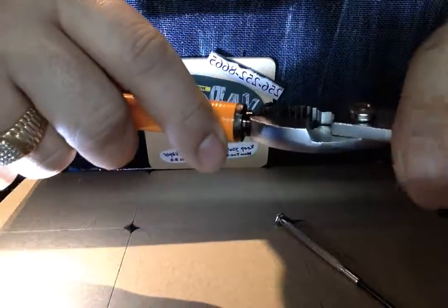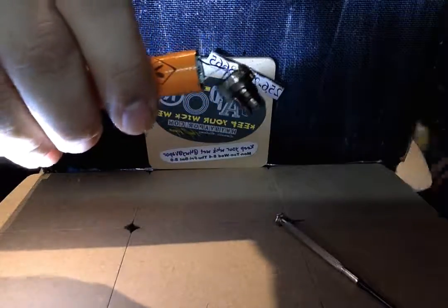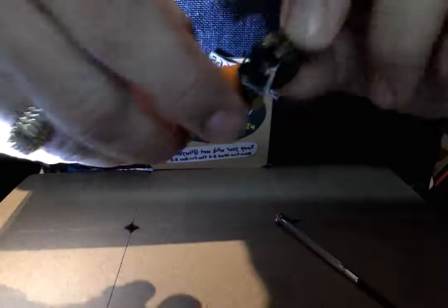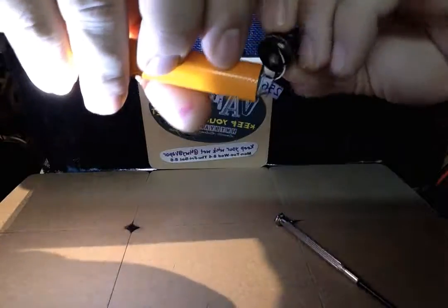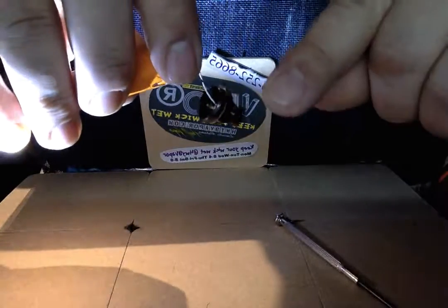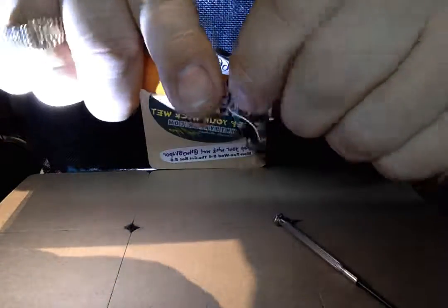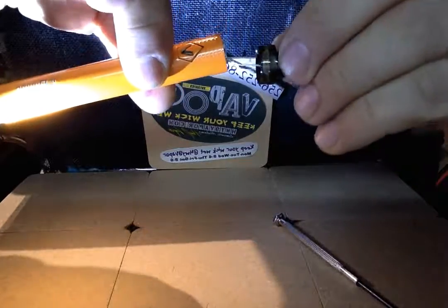So what I'm going to do is take this battery apart to show you more of what I'm saying. As we pull it apart, you'll see there are two wires inside of here. Usually if you spin your tank too hard, one of your wires might pop off. We've got our positive and our negative. Your positive is actually soldered right onto your positive post, and your negative wire is on your negative. When you hit your battery, it's sending both currents up there — one to your positive, one to your negative. The only way for it to take effect is when your coil is in there, it makes a connection to both, your wire gets hot, and that's how you get your vapor. Sometimes people put their tank on too hard, spin it around, and next thing you know one of the wires comes off the negative. They're like, 'my battery doesn't work,' but if you open it up, that solder might have come loose.